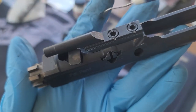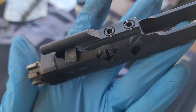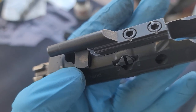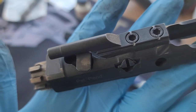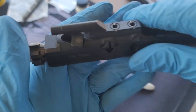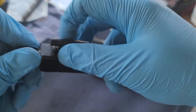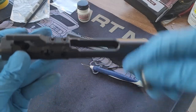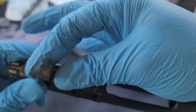It's also smart if you put a little bit of paint and put a dot on either side so that you know which side to reinstall it. From the look of it, one side on my cam pin is more worn out than the other side, so I know which way it goes. Take that out — it can be a little difficult, spin it around, you're going to do this by hand. Cam pin's out, so whenever I reinstall it I need to install it this way.